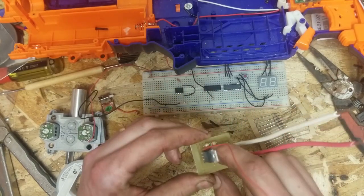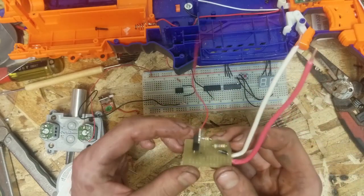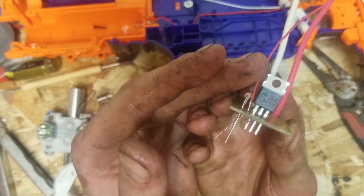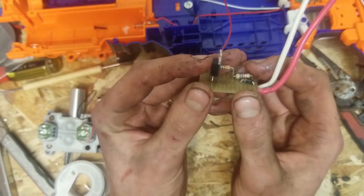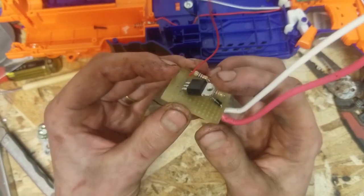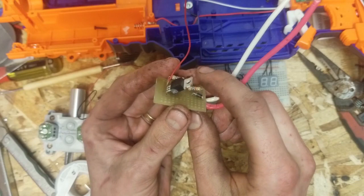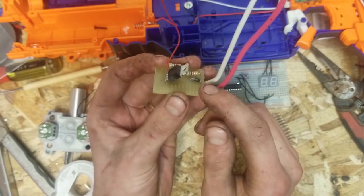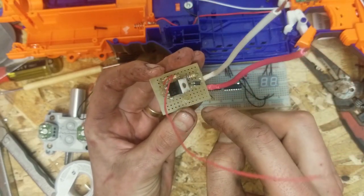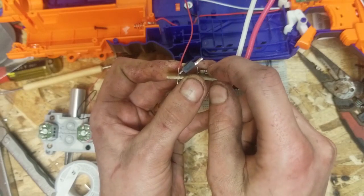is, once you've got it, I'll get the shmoo out of the way. Once you've got it all how you like it, I'm probably going to redo this one resistor because he popped up. But if you leave your MOSFET a little high, then you can actually fold it down onto itself to slim the profile if you like. I mean, you could probably do a little bit better than that. If you really wanted, you could reverse the MOSFET and do everything on the other side technically, and then fold it back this way so this part would be on top of the diode.